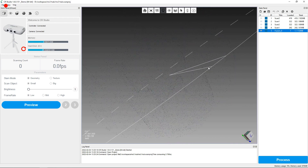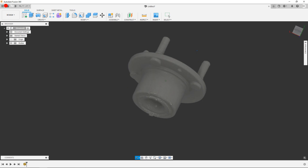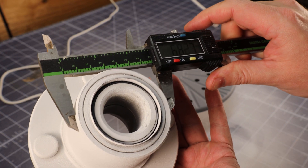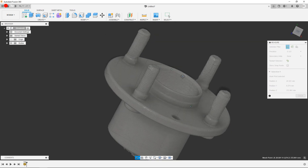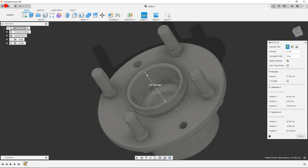As you can see, this didn't come out perfect — there are some weird spots and extra bits where more cleanup and more scans would probably make a better model. There are tools in the software to help remove these manually. One of the major things this scanner is boasting is its accuracy, so I'm going to bring this scan into Fusion 360 and do some measurements. The outer bearing housing is 68.37 mm on this scan, and on the actual part it is 68.25 mm — very close. The center part measured 53.8 mm on the actual part and almost exactly the same in the software. More than good enough for what I would be using this for.